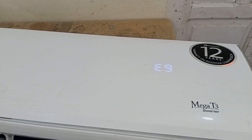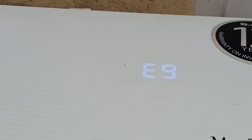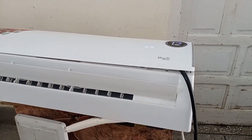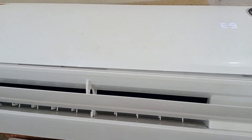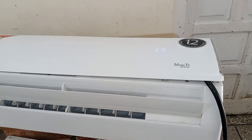The unit's display is now showing an E9 error, meaning the unit has identified the issue as E9 and it needs to be fixed. The indoor blower motor is continuously running — even if you leave it for hours, it will keep displaying the error and the blower motor will continue to run.